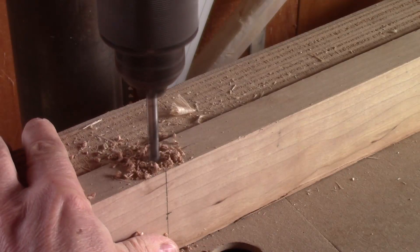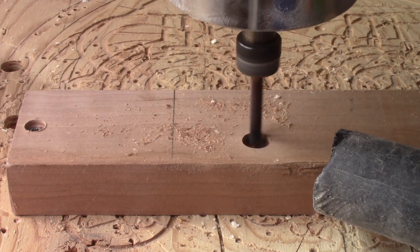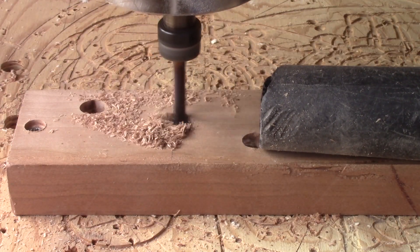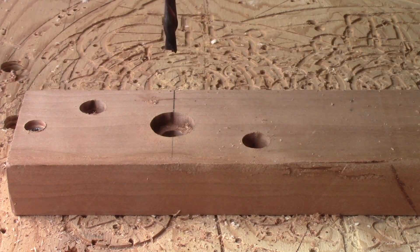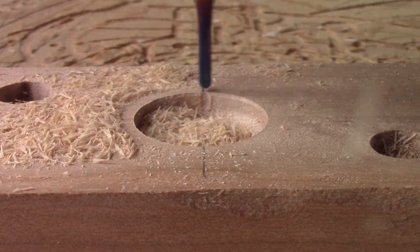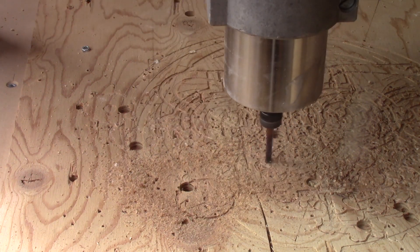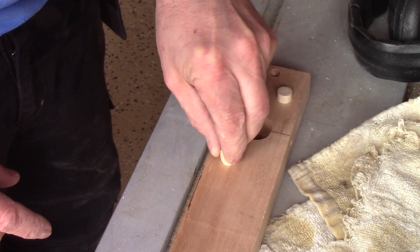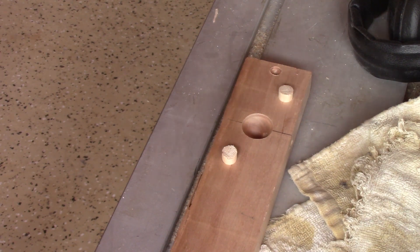The first thing to do is a hole for the air hose — it's in the center of the piece of wood I'm using. Then I go to the CNC. I begin with a roughing pass. In this pass, I also drill the two side-aligning holes. When it's done, I switch the bit and do the finishing pass. I put the larger bit back on and drill some holes in the plywood I've screwed to the CNC table. Those holes will serve to align everything for the other side of the cut.